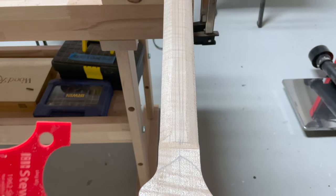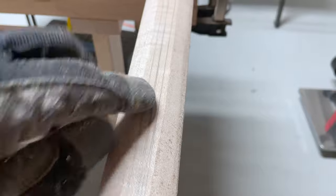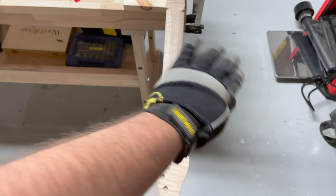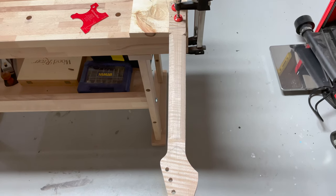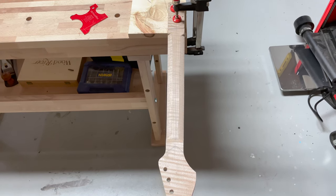The second set of facets goes way faster. Putting the template down, I'm starting to see some of that rounding shape. I'll hit these hard edges to round them over, and then I'll take a step back and do some sandpaper across this way to start building in that oval or C-shape — probably 60 or 80 grit. Then I'll check where the neck is and start carving out the heel and volute areas.